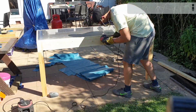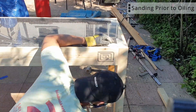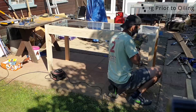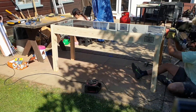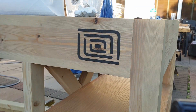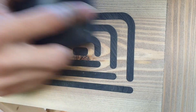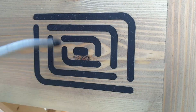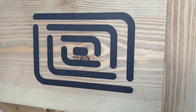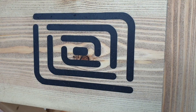I'm hitting the bench with 60 grit on an orbital sander and then I moved to 120 grit. I don't really see the point of going any higher than this with pine. However, for the logo I did go up to 1000 grit, because the granite effect I was going for really does come out at those high grits — you can really see it here. It looks really good and with a lick of oil it looks even better, so I'm really happy with this.